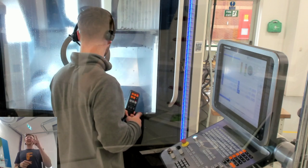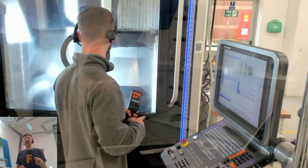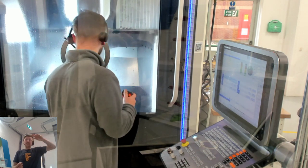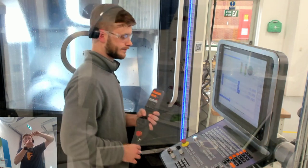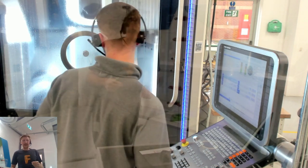So Dylan, what's that, a 12mm? Is that 12mm in there? 16, that is. 16mm. You can see how far away from the machine I am. So 16mm is going to wind that near the block, is then going to rotate it backwards with his hand and use a slip gauge or a piece of paper. I think he's got an old setup sheet he's going to use. Paper. And he's going to feel when it grips that bit of paper.